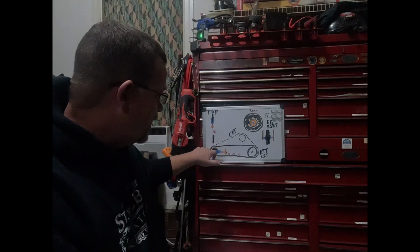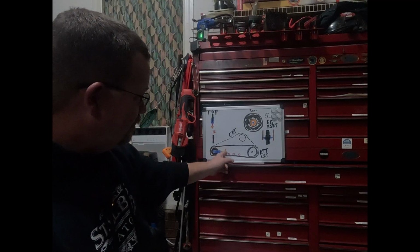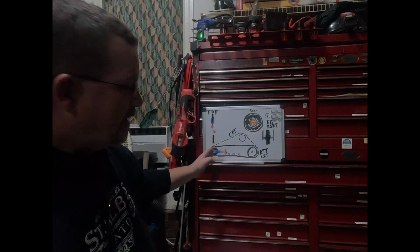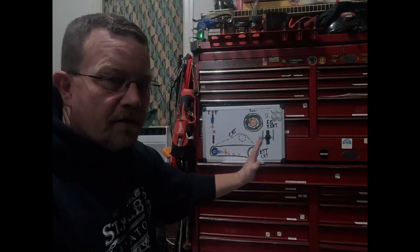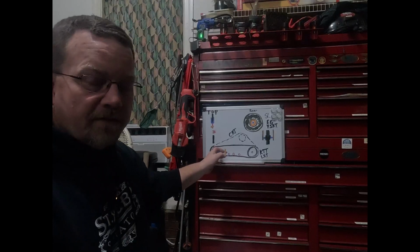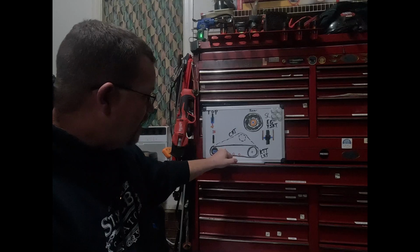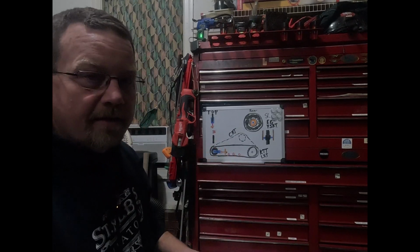Then come up here to your idler assembly. You can take this front piece off, but in here where your shaft is and everything, you really don't have to take it off. But your biggest thing is just to push on it and see if it goes back any further. If it does, then maybe you've lost the seal for the grease, or this nut's starting to get loose and the shaft's gotten loose, or something in here has caused this to come back.